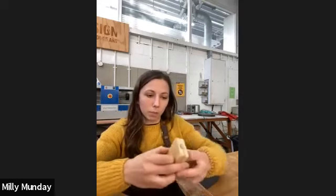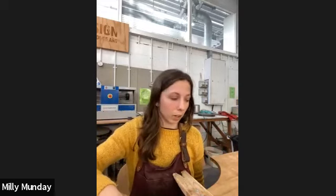One of the main cons with it is that shrinkage will occur with a vulcanized rubber mold. So whatever it is that you're making a mold of, once you have the waxes, they will be smaller than your original. So that's something to bear in mind when you're making multiples with rings. Your ring will be a good couple of sizes smaller from the vulcanized mold.